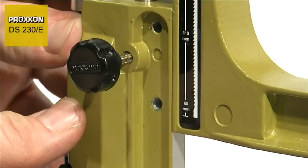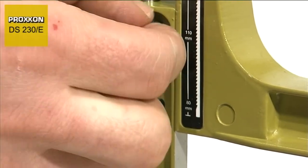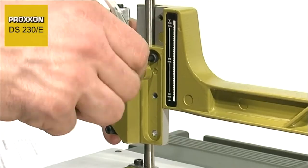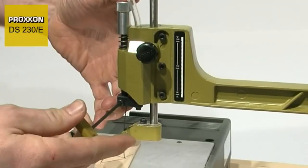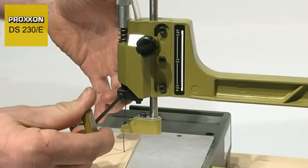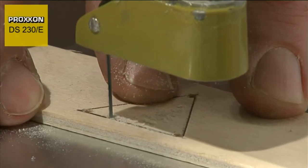Shortening the blade and adapting the head position increases the service life of the saw blade's manifold, as the full length of the blade teeth can be exploited in this manner. In addition to this, it is also possible to achieve even greater precision with a blade shortened by approximately 60mm in the lowest head position.